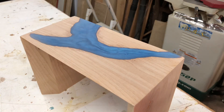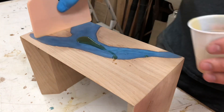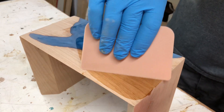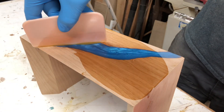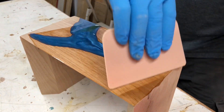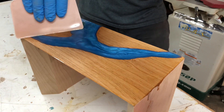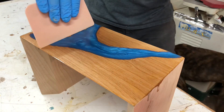I really like the micro zip here — it gets into all those tight cracks. I used Rubio Monocoat on this one. It's a really nice finish — a one-step deal where you use a squeegee to put it on, you only need one coat, and it looks amazing. It's more of a natural, oil-wax finish and does not have a gloss to it, which I actually like. I've pretty much started using it on almost everything — slab work and all that kind of stuff.